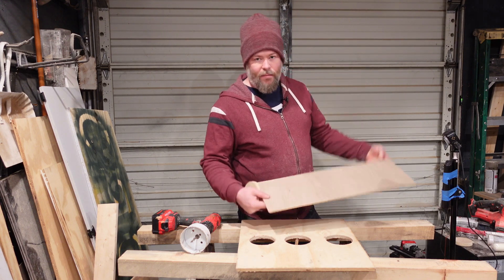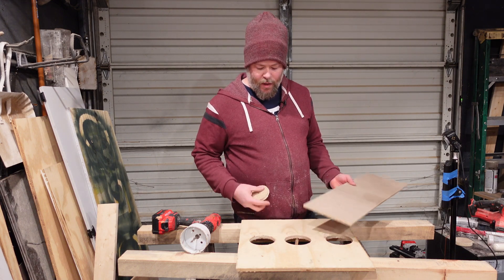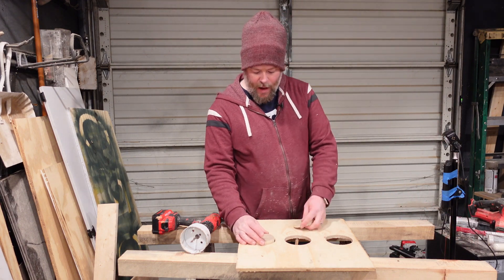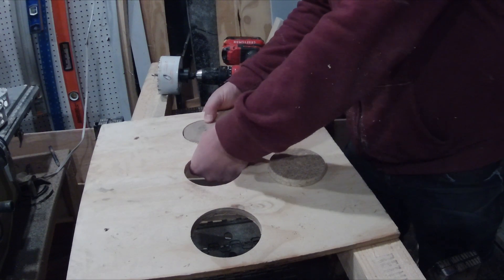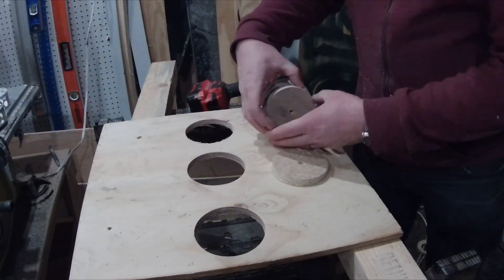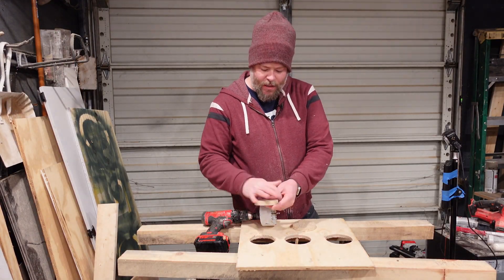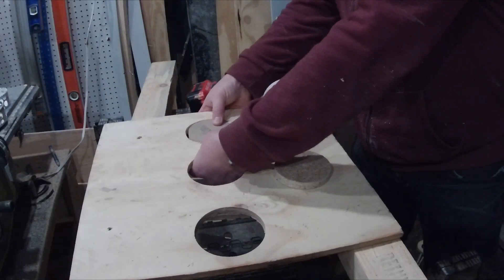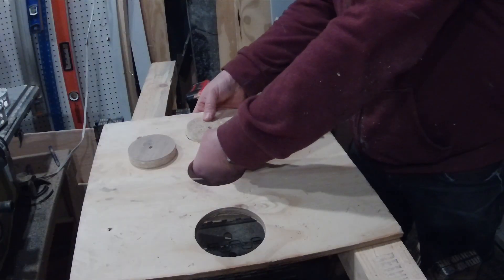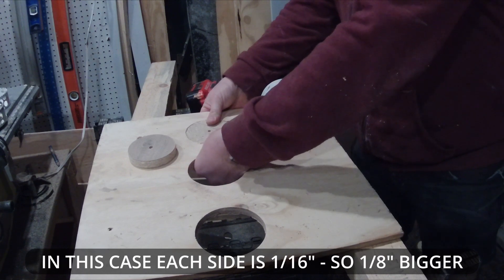I don't have anywhere I could clamp onto this thing, and I also don't want to end up putting holes in it that I have to fill later because this is a pre-finished material — it has a vinyl sticker on it that I don't want to punch a hole in and then refill. So what could I do? The easiest thing is to take the hole saw remnant and put it in there. Now this is a little bit smaller than the hole because you have the teeth going around the hole saw, which makes the inside just a little bit smaller — you actually lose an eighth of an inch because it's a sixteenth on either side. I've used the same size before and it's fine, but if you want to be specific about it, take the next size up. This is the three and three-quarters, and because it loses an eighth of an inch — which was the difference I was dealing with — it actually fits very snugly in the hole.